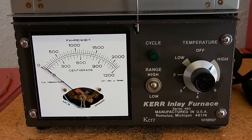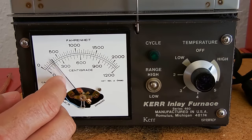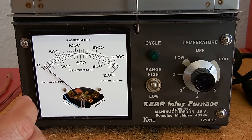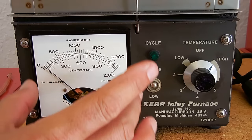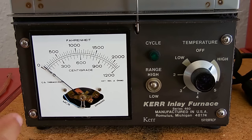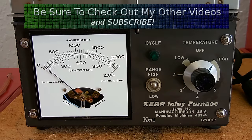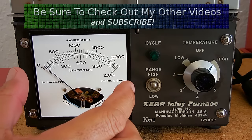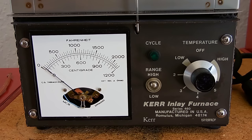What I need to do to make this unit complete — it is missing the protective cover over this gauge. I don't want to ever damage that needle as it'll have an effect on the accuracy of the unit. So what I'm going to do is make my own vacuum-formed cover out of acrylic material to go over the gauge. Once it's made, I'll apply a little bead of E6000 in each corner or clear silicone and then slide the cover over the gauge.